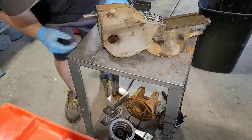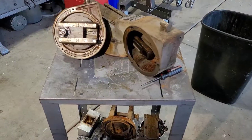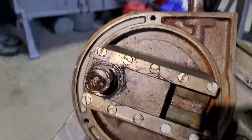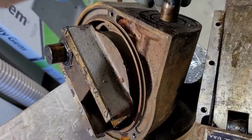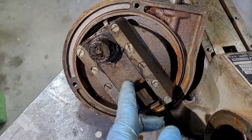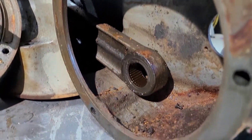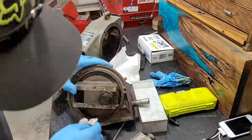Now we're getting ready to break into the crankcase itself. It's a worm gear driven crankshaft and we're going to pull this thing apart. You can see the inner workings — right there is essentially where your crankshaft is and that moves up and down. When it comes to the center you're going to have very short strokes, and when it's all the way out like it is currently, that gives you longer strokes for cutting longer keyways. Right there you have the connecting rod — it has needle bearings in there and there's quite a bit of rust. This thing was neglected, sat in the shop, got wet and rusted.